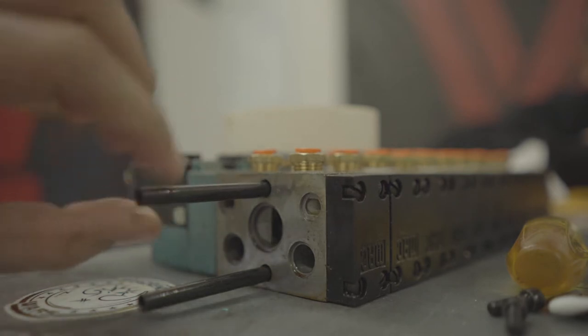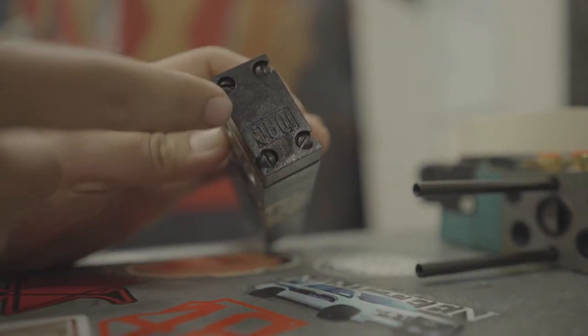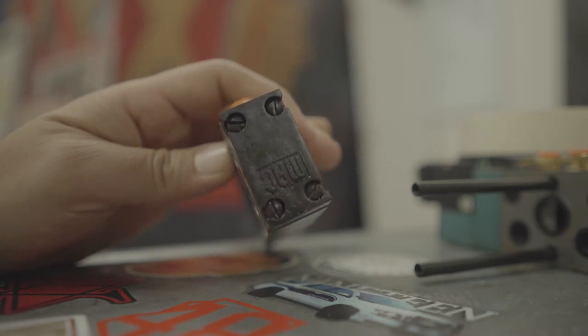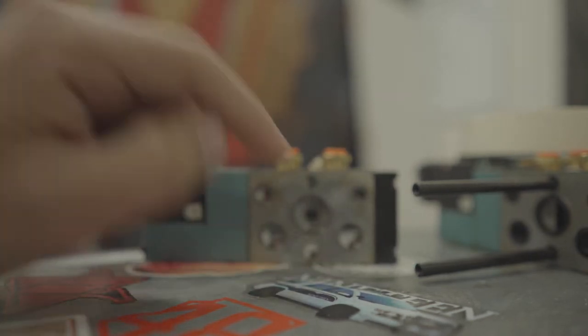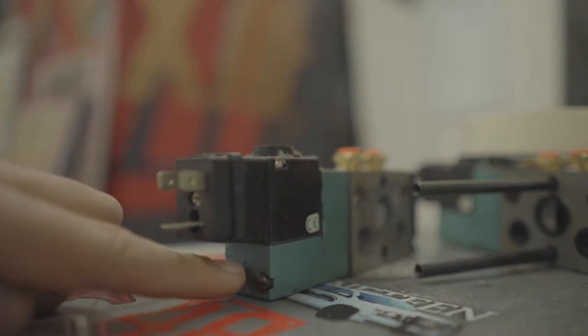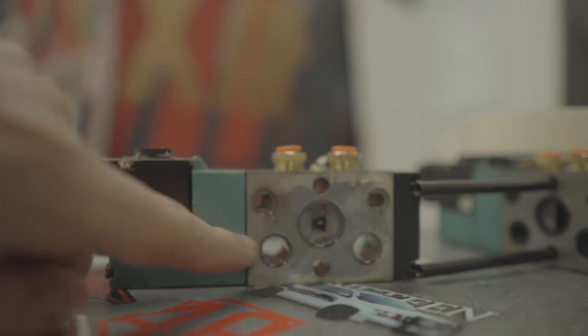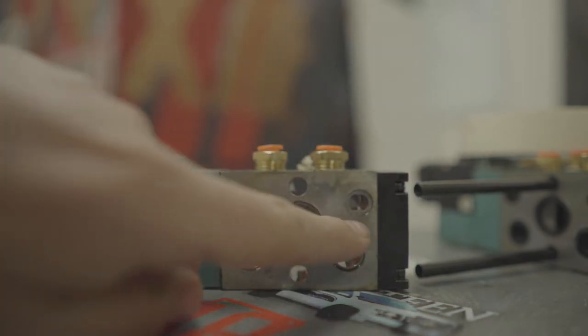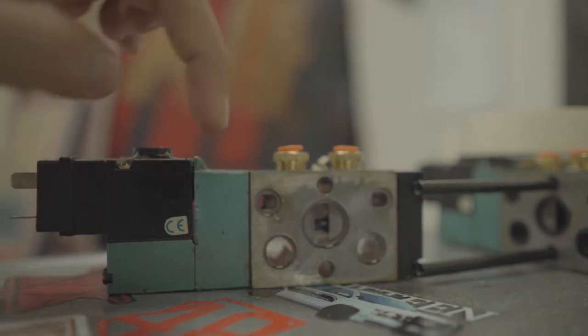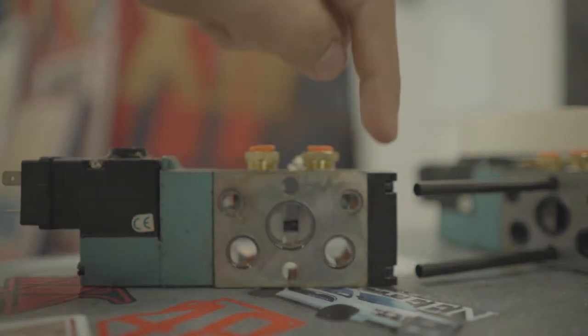When I take them out they slide through these bars — that's how they stack with each other. There are four screws on the back, and that is where only one gasket goes inside. There's a piston inside that's spring-loaded. Instead of taking the back part out first, I take out the front part. On the front there are two screws, and on the top there are another two screws that get the middle part out. We're going to bring the piston out — which we'll be replacing — along with the spring. The only gasket that gets replaced is the one between the blue part and the metal part.